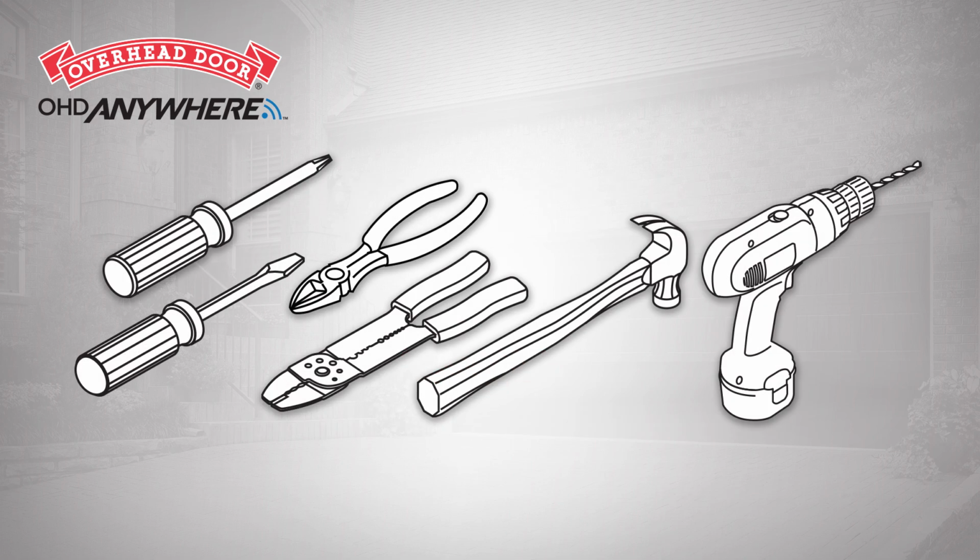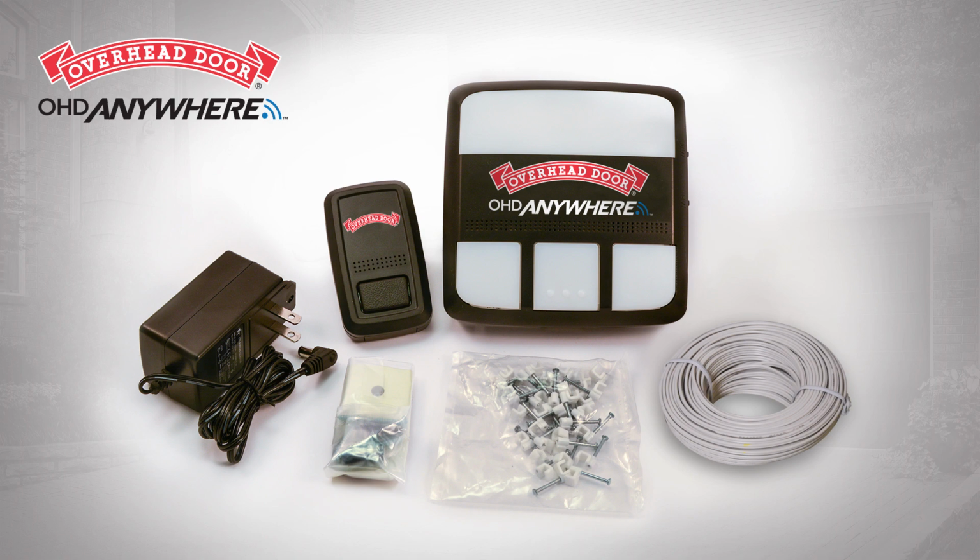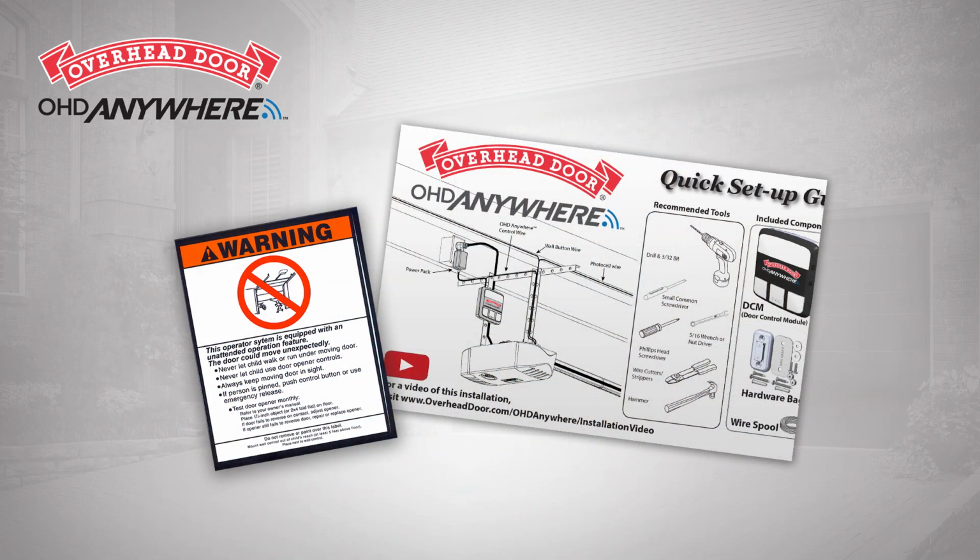The following tools are needed for installation: a flathead and Phillips screwdriver, wire cutter, wire stripper, hammer, and an electric drill with a 3/32" drill bit. When unpacking your OHDAnywhere kit, please verify you have the following items: 1 door control module, 1 door control module power cord, 1 door position sensor, a spool of wire, wiring staples, and mounting hardware. Also contained in the kit is the quick setup guide and warning label. Be sure the label is applied as directed in the instructions to help prevent potential injuries.